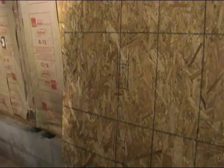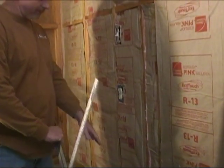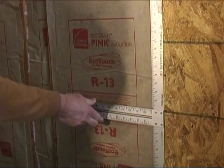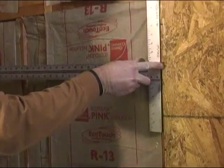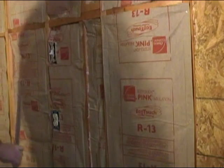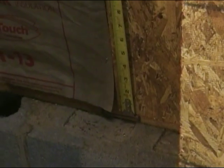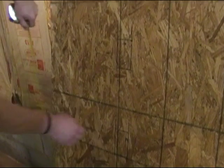To figure out the top and bottom of each box — since our plywood is not on the brick, we can't just take a measurement from the brick up — we took our sheetrock square, held it up against our existing piece of OSB, ran it up to the bottom of the box about where we want it, and put a mark there. Same thing at the top. Same at the bottom of the other box, and the top. From those marks, we took our tape measure and measured down to the bottom of the OSB, figured out the exact measurements, came over and transferred them onto our new piece, and squared the marks. Now we're ready to cut out these openings and put it up to see if it fits.